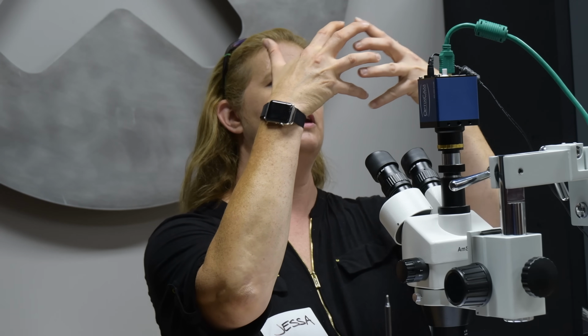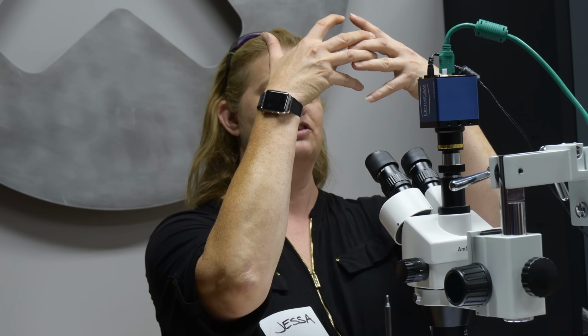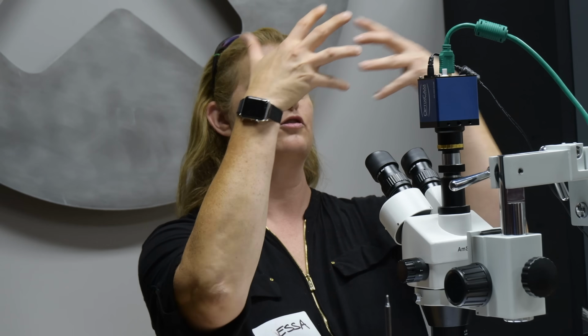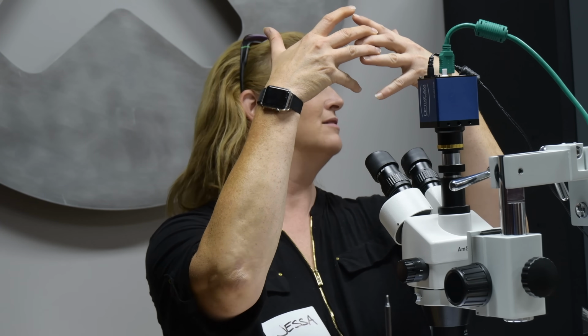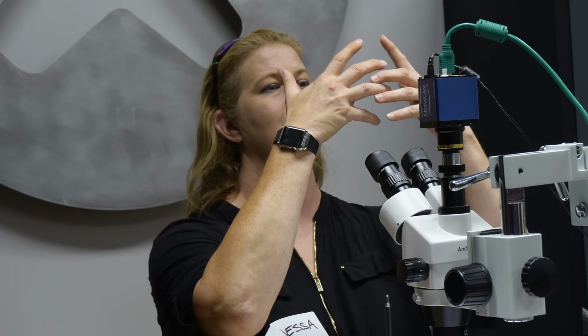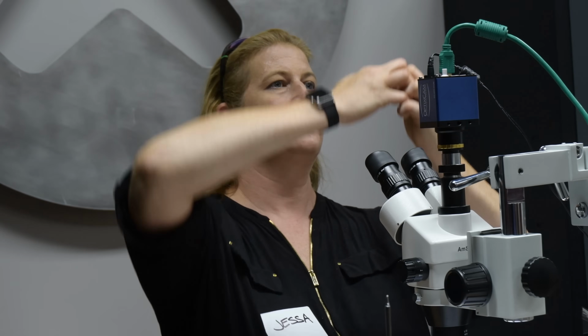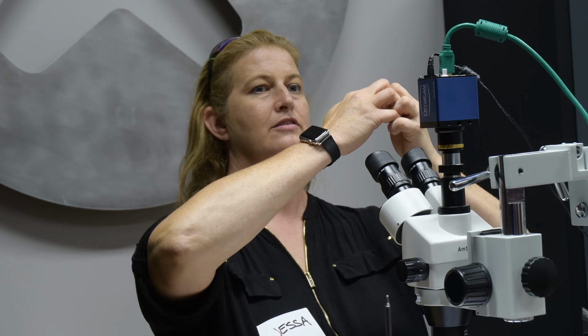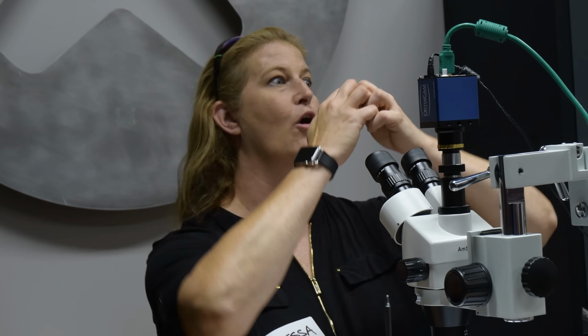So you tell me, how do you think they fail? They touch. So therefore, the capacitor becomes a wire. Yes, exactly. So a capacitor can fail by becoming a wire. Now, once that wire is created, what happens to the line? It's always connected to ground. Exactly. So then it's always connected to ground.